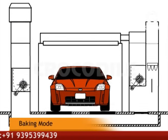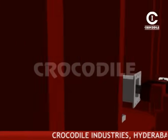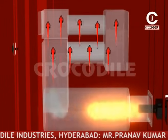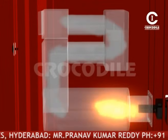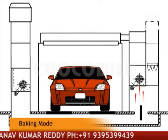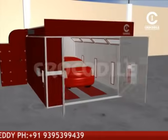Once the painting is done, the damper positions are changed and the diesel burner will be switched on. The diesel burner burns inside the heat exchanger and the air circulating in the blower unit becomes hotter. This hot air is made to circulate through the booth and the blower unit, aiding in the quick drying of paint in a dust-free environment.